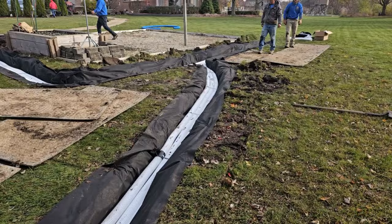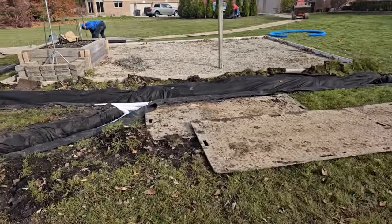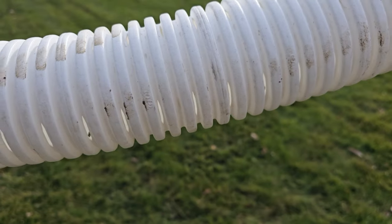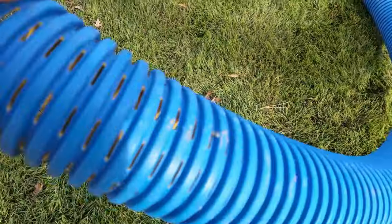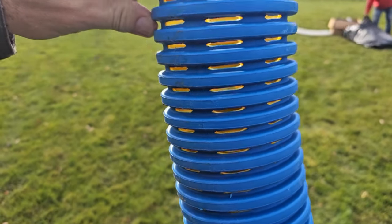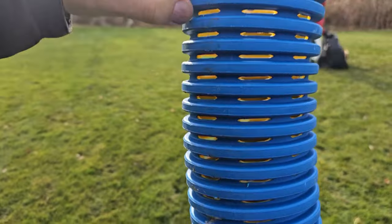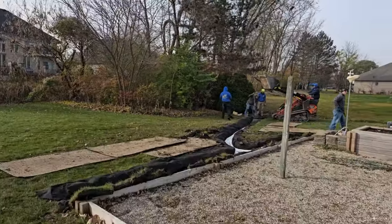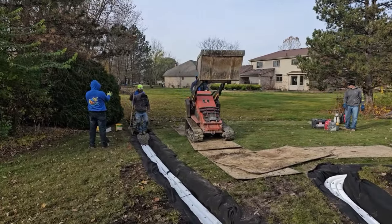We had those windows of perforations opened up so big on the blue pipe. You can see the perforations throughout the three-inch pipe. The bottom pipes are key — extremely important. We pay extra to have a heavier sidewall and we pay extra to have the cutters stay in during manufacturing — they slow down the machine so the cutters stay inside right where they open up these pipes. You're not going to find a pipe like that. It was purpose-built, special made.